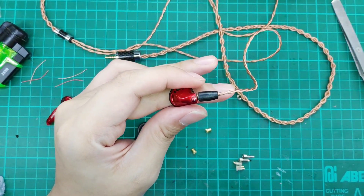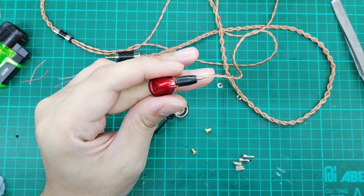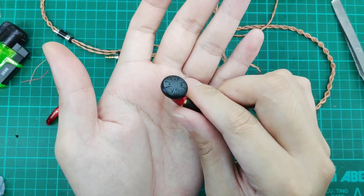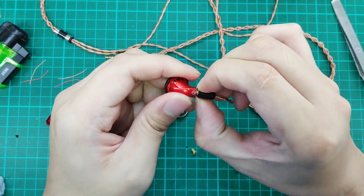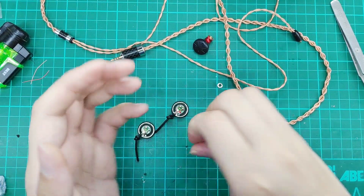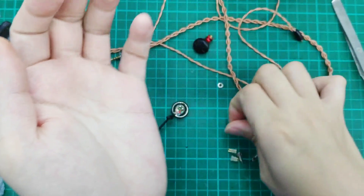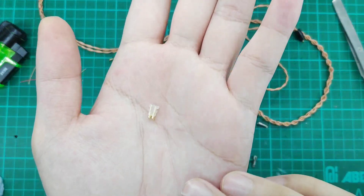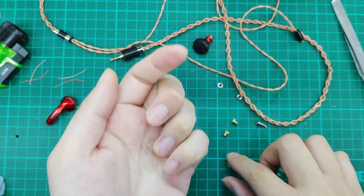For the LL series, we will need to check, because the LL series is so good that we do not need to mod them. All in all, this is a fun modification on the Monk itself. We do have MMCX connectors available — the easiest type, the long MMCX, and the flat MMCX. You can also do it into 2-pin if you want, with patience and the proper tools. Venture Electronics has already done the 2-pin version for all their LL and new series.